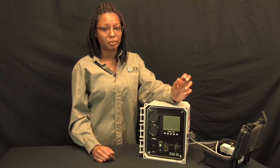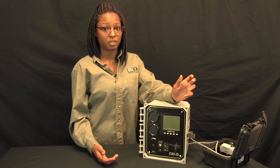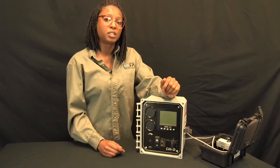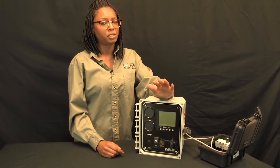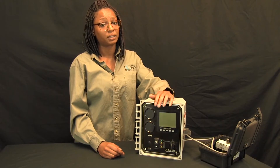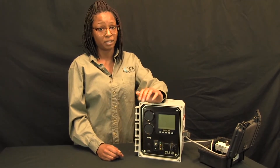In order to get into the auto start parameters, you have to turn the key to the run position and hold down the far right button to get into the configuration menu. Just be mindful that you don't want to change any of the parameters for the CP750 in auto start mode, due to the fact that the engine might start if a start event is current.